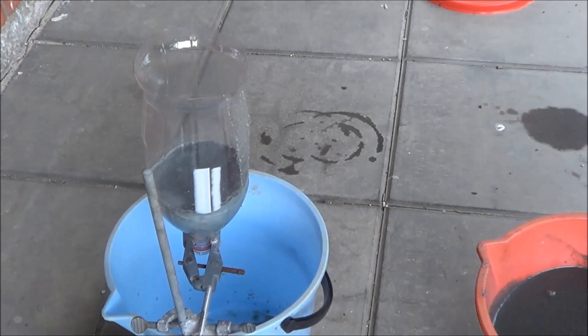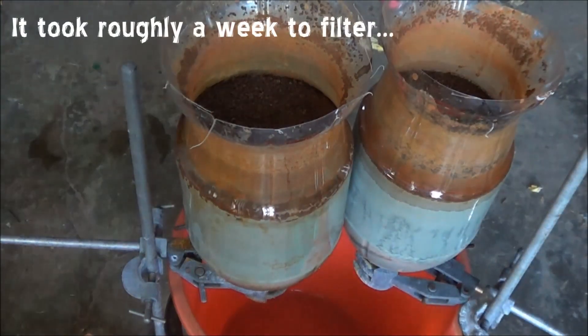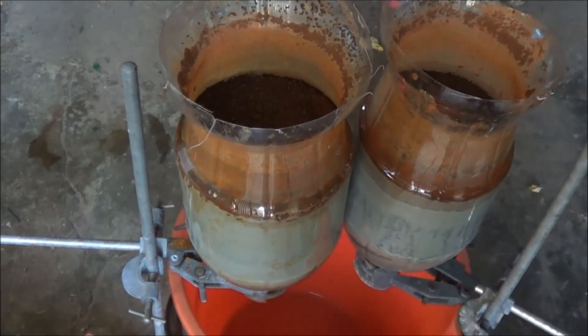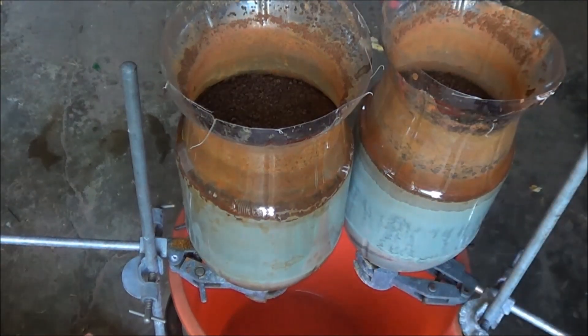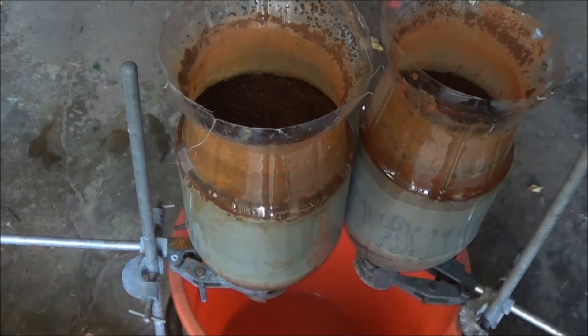This is going to take ages. So I have the two containers of the carbonates — some metal carbonates. Hopefully this is the first step where we'll be able to extract chromium by itself, away from the nickel and the iron. I'm going to do that by adding a hypochlorite solution — calcium hypochlorite — which will hopefully oxidize the chromium carbonate to calcium chromate, and leave the iron and the nickel as the carbonates.